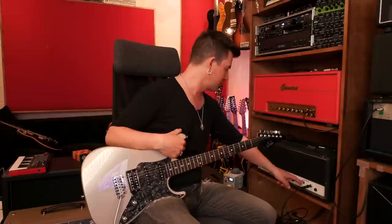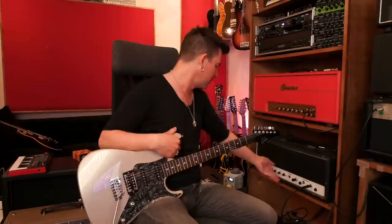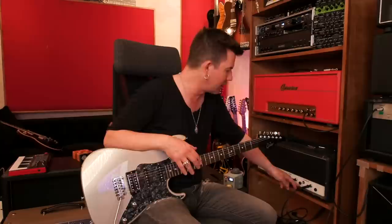There have been a couple of mods done to this amplifier. On the treble channel — the main channel for guitar — there's a toggle switch. On the bass channel, there's a two-way switch that makes the amp sound normal in one position and really dark in the other; that dark position is almost useless. On the treble side, Dave said it was originally a two-way switch that switched in a bright cap but kind of sounded useless, so he replaced it with a three-way toggle.